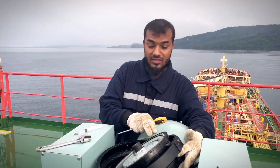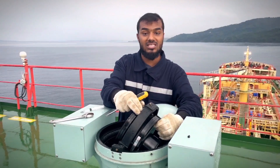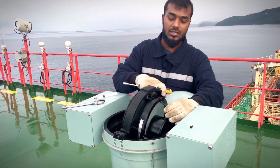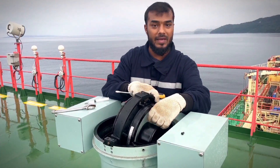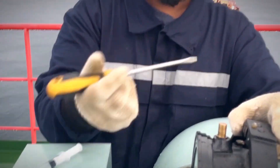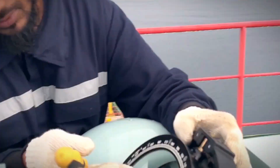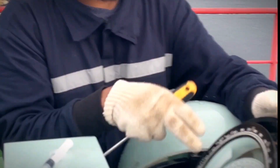For the Tokyo Keiki model, the only way is to take out the gimbal arrangement — otherwise you cannot do it. On some other models there is a rubber pack arrangement to push liquid through, but this model does not have that. So the only way is to take out the gimbal, remove the knob, then either press in more water or the mixture, or take out a little liquid and position the bubble exactly on top so the air releases automatically if you keep it slightly open.